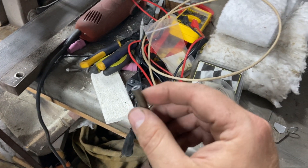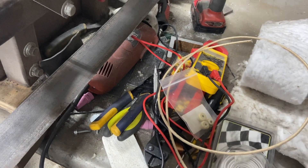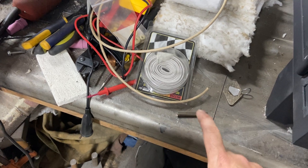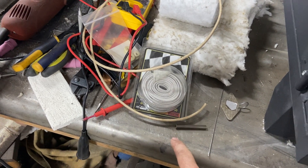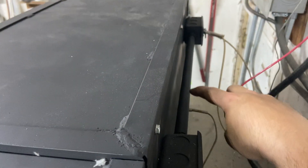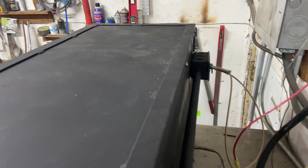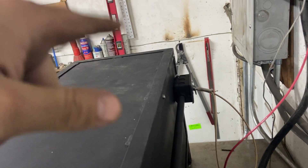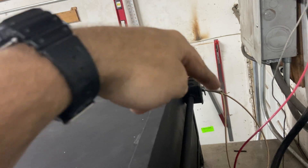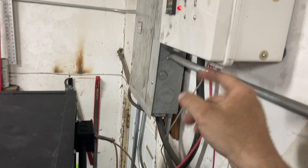I crimped some tubing onto the end of each element lead — kind of a poor man's electrical connector, really. This passes pretty good current. I crimped one side onto the element, maybe a three-quarter to one inch long tube, then the other side to a stripped back portion of high temperature wire. On the front lead I ran it through conduit into the rear box, and on the rear lead I crimped another piece of high-temp wire directly to it, then brought those out with insulated spade connectors connected directly to the PID controller.